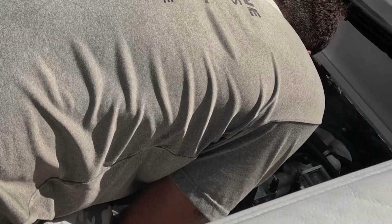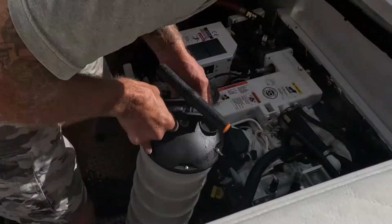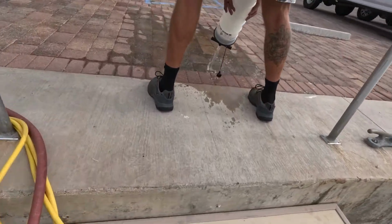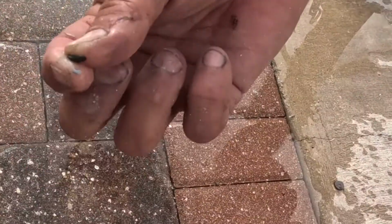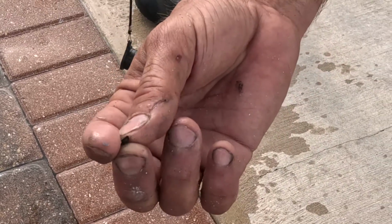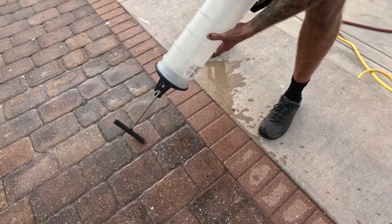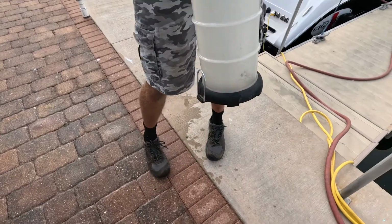Turn it off! Look at all the sand in the bottom. Oh yeah. A little bit. It did get a lot of these guys out of there, which are the impeller. Anytime someone changes out an impeller, if you have a shredded impeller, always have them back flush the system because those pieces get stuck in there. There's sand inside there, huh? Yeah. A little bit anyways. Oh, a lot. Yeah. There's a lot in the bottom.